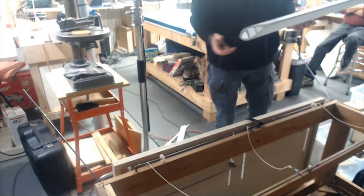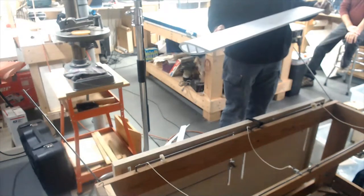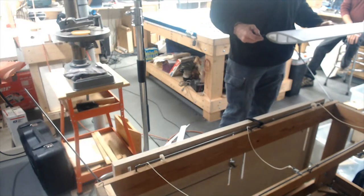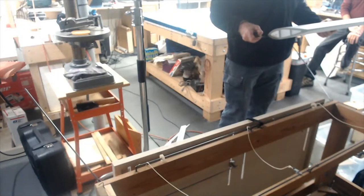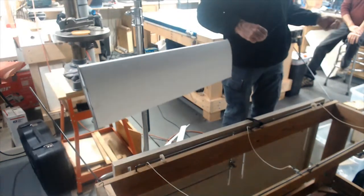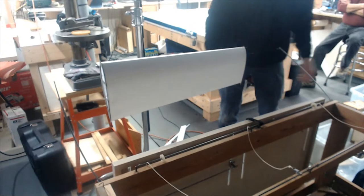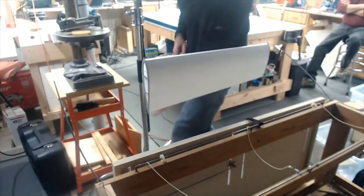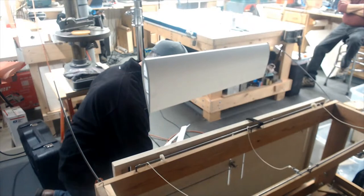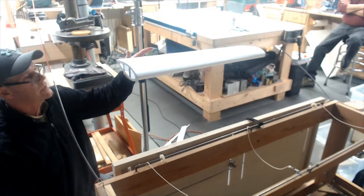You gotta have the big end opposite the release. Yeah, I'll get it right. So the big end has to be on the stationary wire. Yes. If you're doing that on the feather cut machine, it does the same thing. Yeah. It does identical. It'll burn them and lock up on that little core piece and you're stuck. Yep. About every time you do it. I always watch the root versus the tip because the root takes longer than the tip to get to the template. So I know if the root is where it needs to be, the tip is because there's less room to cut.